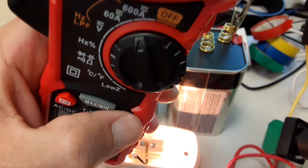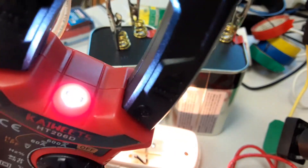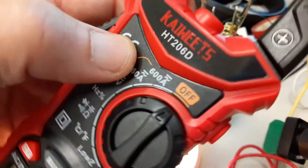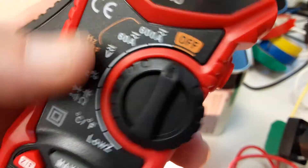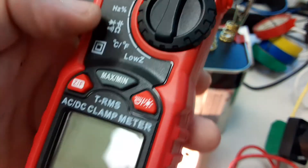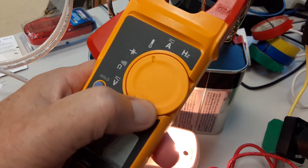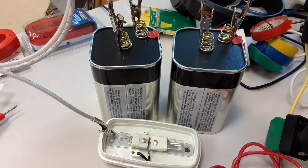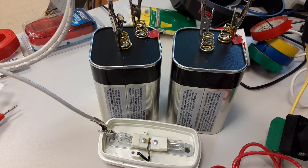It also has a little flashlight built in - hold the button long enough and you've got a flashlight. That can be handy when you're working in a control cabinet without good lighting. So I kind of like this one. It's on Amazon - the model is HT-206D. The knob is convenient if you're right-handed like me. Fluke meters are also very good with a similar setup. So there's DC current measurement with both meters using magnetic clamp sensors. If you don't have one of these types and only have a bench meter, you'll have to break the circuit - maybe I'll show that in a different video.